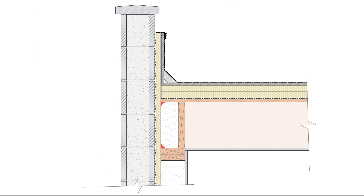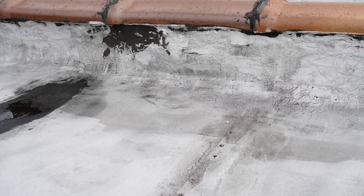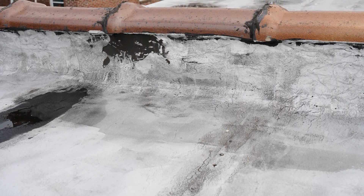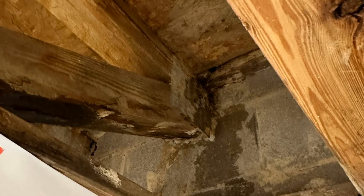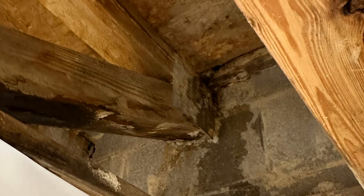We also need to find a way to terminate the dimple mat at the top of the wall. This is extremely tricky when dealing with a low-sloped or flat roof, and we tend to see a lot of moisture-related issues at the connection between exposed CMU walls and roof membranes — usually in the form of blisters filled with water around the parapet transitions. Even worse, we can see moisture on the interior dripping down from the roof structure at these locations, which is often mistaken for a leak.